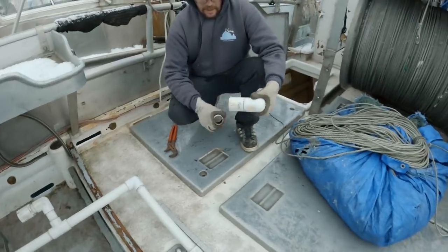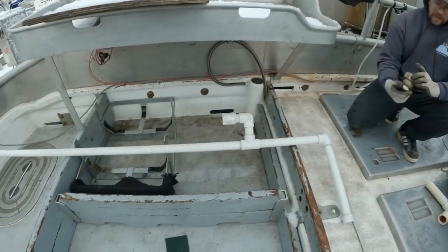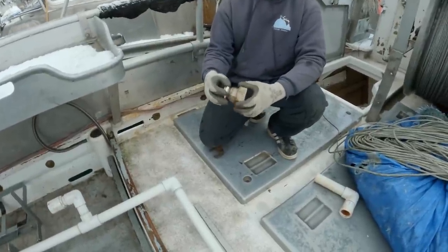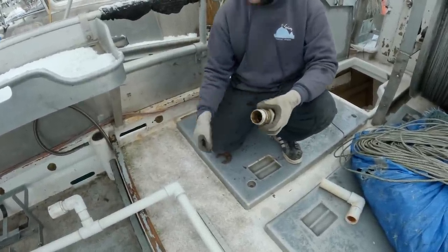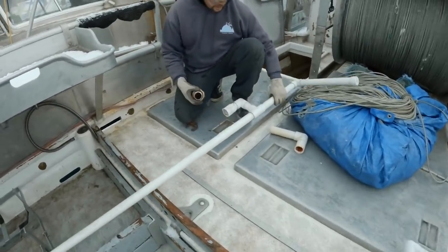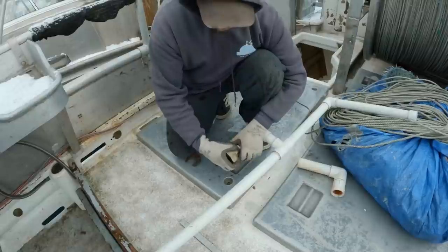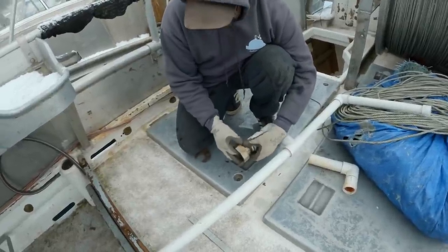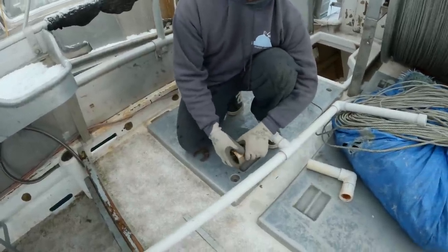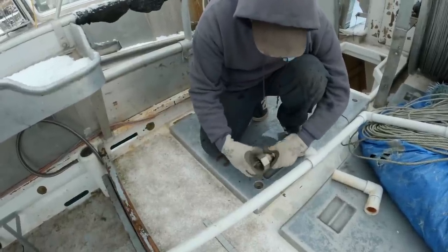Yeah. So quick transition to the fitting. You change your sump pump into a circulation pipe. Just have some big 316 stainless coupling right here. We welded a pipe fitting onto it when we first set this up, and this one is for in here, I guess. I'm not gonna bother putting tape on here just because it doesn't really need it. It's pushing water out, not sucking water in, so I don't have to worry about pulling air through. Don't need to tighten it up much anyways.